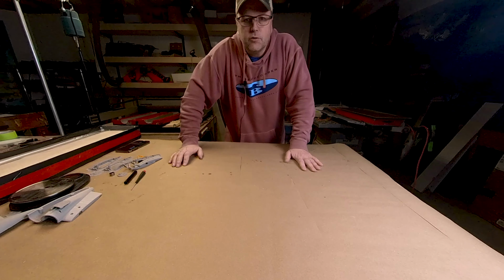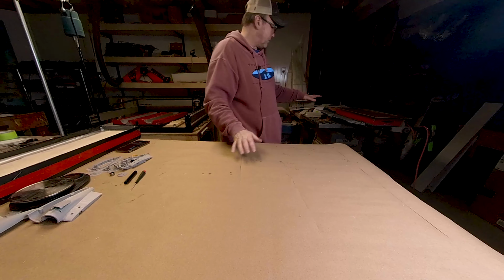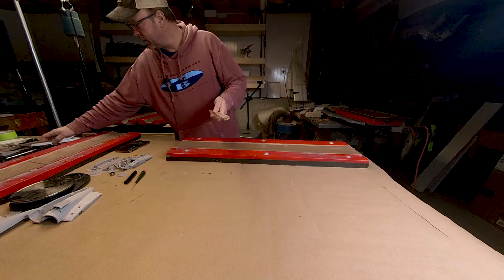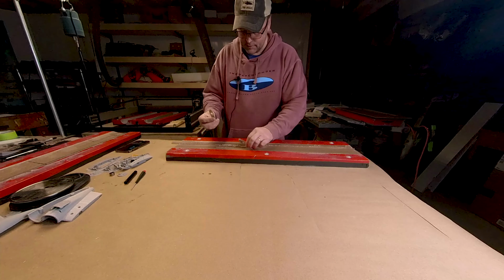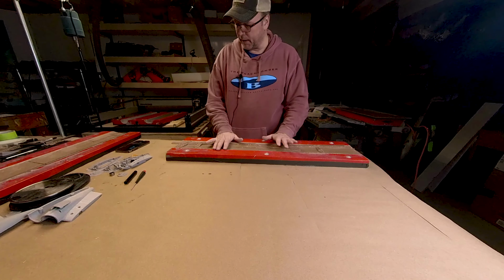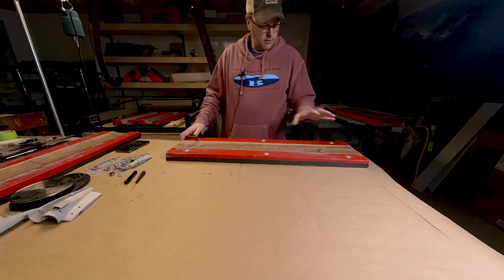All right, so to give you an update of where we are with the overall project, you saw the front wing. The front wing is pretty much done and ready to go. The rear wing halves are done. The honeycomb is in, and they are ready for their internal structure. So these are all the bits and bobs. This is the main shear web, and then the individual ribs, which have all been cut out of the 3 millimeter fiberglass honeycomb panels. Those are ready to go. In fact, this weekend I'll be gluing up the wing with the internal structure, so those will be ready to start fitting the motor pods or the nacelles probably next week.